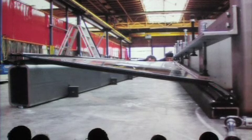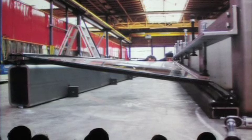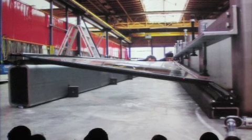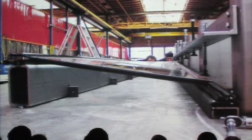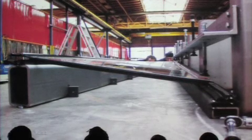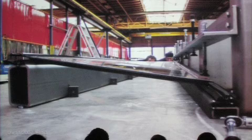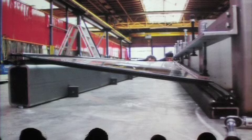Yeah, it's actually laminated and insulated. The bottom sheet is laminated because it's overhead, so if it broke, it must stay there. The top is toughened glass, actually, and this is insulated, so there's an air gap in the middle. And with all insulated panels, they do not like you to deflect the panel over a certain amount because it stresses the edge seal and it can break down. So that was our big worry, that they wouldn't warranty it.